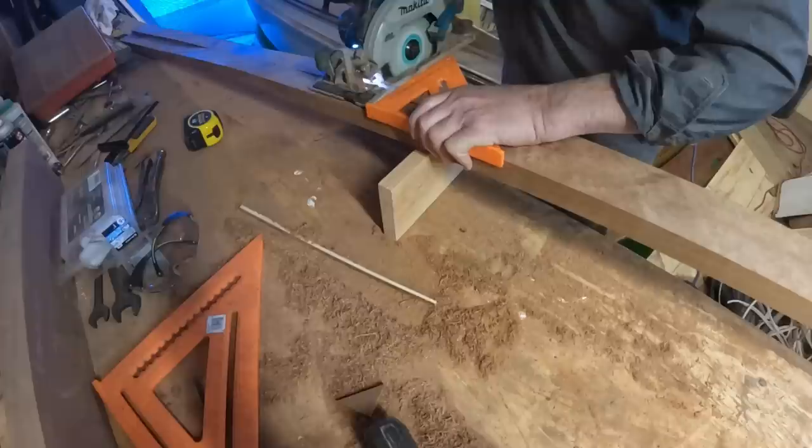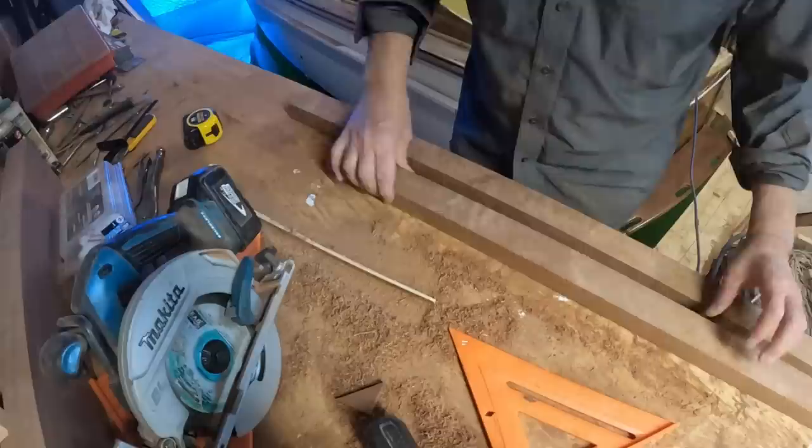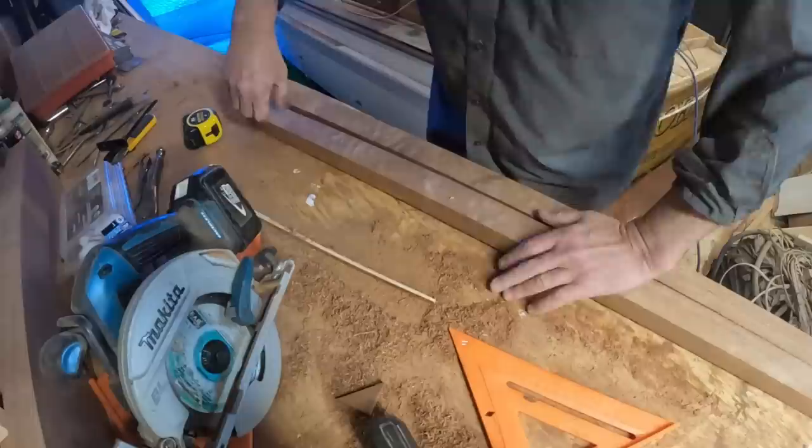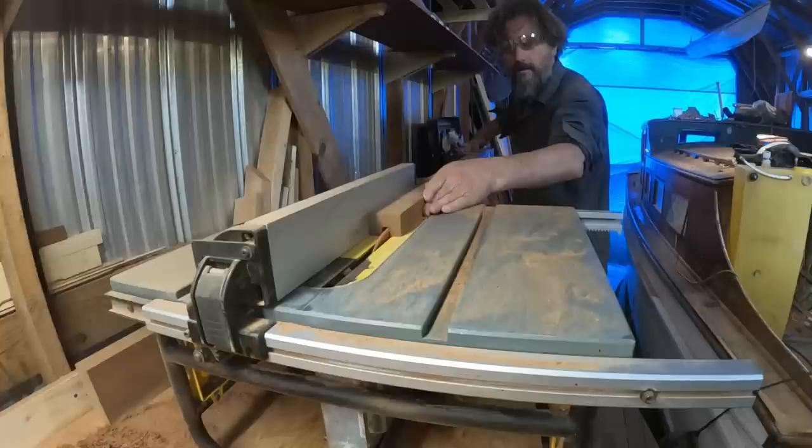Now this particular piece of wood has a tremendous amount of figuring in it. In other words, it's not very straight grained. So in fact, it's almost useless for many, many things. It's okay for this door frame because it doesn't have to be particularly structural. I mean, it's not weak, it's just not ideal. Anyway, it might look actually quite pretty with all that figuring in it.